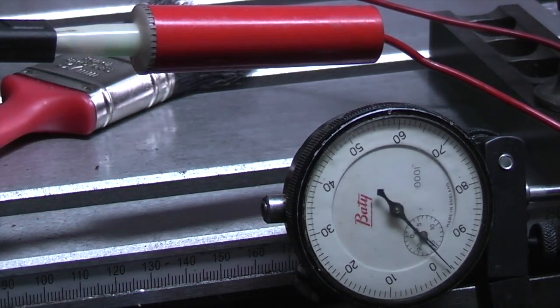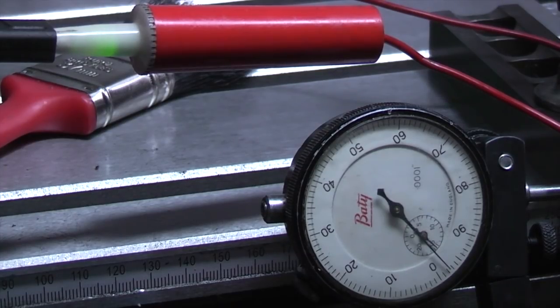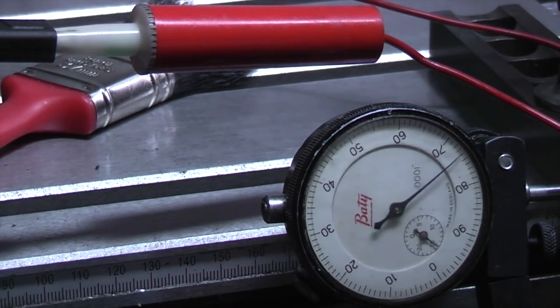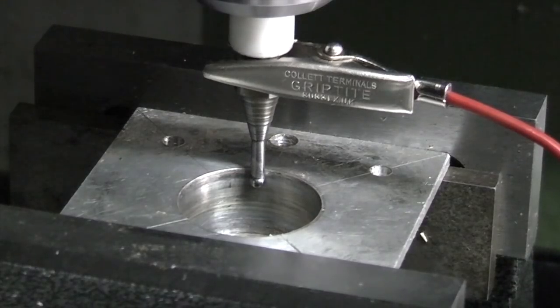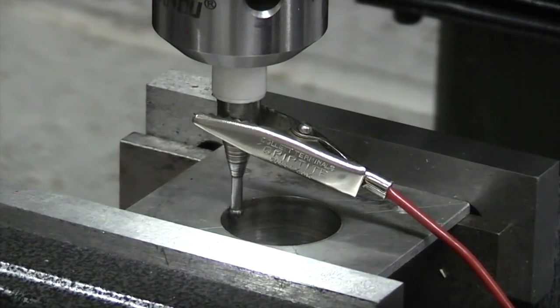Take it off, come back again - about two and a half tenths from zero, so you've got repeatability. But the advantage of this is you don't have to have your machine running - you're just using an electrical contact. So you can go around and as soon as the light lights up you're touching, and that's repeating within half a tenth. The other thing about this is that the probe will be able to fit into a hole, and if you can ensure that the ball is running true to the spindle you should be able to calculate the diameter of the hole and the centre position of the hole. And of course if you have digital readouts fitted to your machine, you'll be able to find the centre and calculate the diameter a lot quicker.